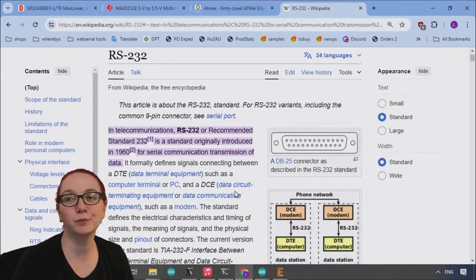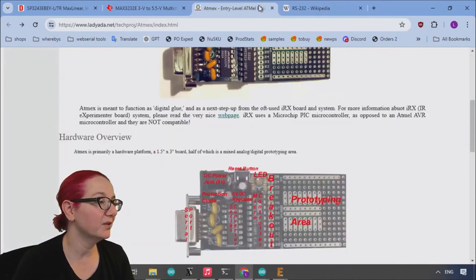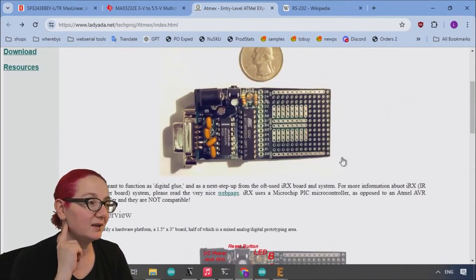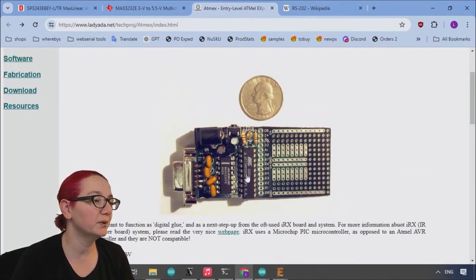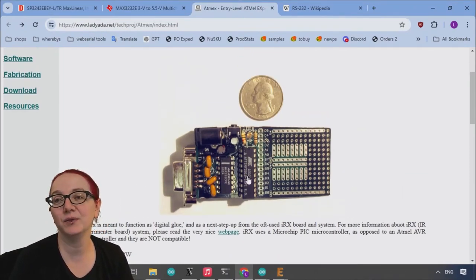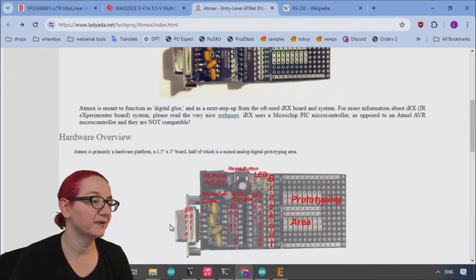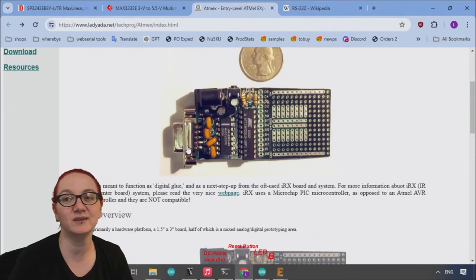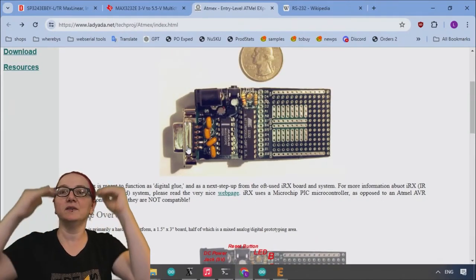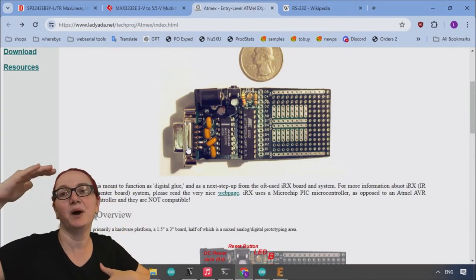Like I said, it's definitely older, but it was on every computer. One of the first microcontroller boards I designed, before USB was on computers, to program the bootloader on the ATtiny 2313 you would use a serial port. You needed a serial converter because RS-232 voltages were not 0 to 3 volts — it was negative 10 to positive 10.